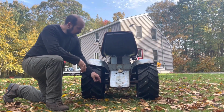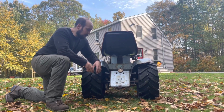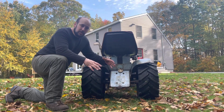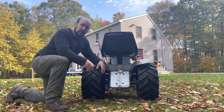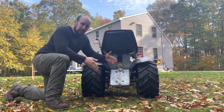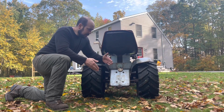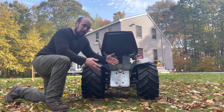But another option is to actually have a 3-point hitch, which I have. It's not on the tractor, but I do put it on because I have a 5-gallon pail of concrete for add extra weight for snow removal. But the Sears 3-point hitches are pretty basic. There's a big lever that picks it up and down. It's not hydraulic, and it's narrower than a normal Category 0 3-point hitch. So instead of 20 inches wide, which is the standard for Category 0, it's 16, so it's 4 inches narrower. So you can't fit normal Category 0 implements on the Sears.